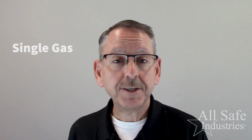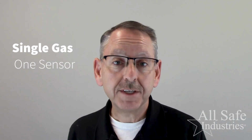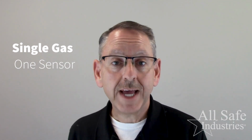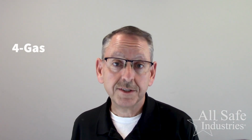A single gas meter is just that. It's designed for one sensor to detect one type of gas or a family of gases like combustible gases or volatile organic compounds. 4 gas meters are by far the most popular choice and utilize 3 or 4 sensors to measure the gases that you would most likely encounter in a confined space. They are oxygen, flammables or combustible gases, carbon monoxide, and hydrogen sulfide.